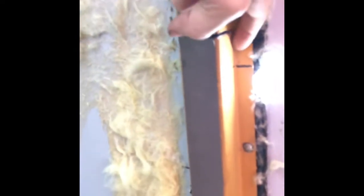What I'm going to do is get a reciprocating saw and cut this whole thing. I'm going to have two more holes like these on the other side. I'm getting ready to get my reciprocating saw and zip this member from here to here and from here to there. That will take down the bulk of that part of the frame. When I get that frame down, I can get back in here with my grinder and grind this off. Now, I don't know if your bus will be this way or not, but you need to pay attention really closely.